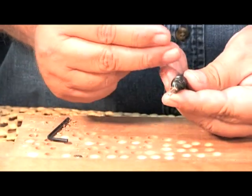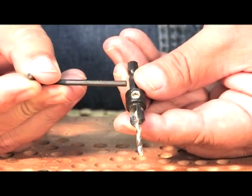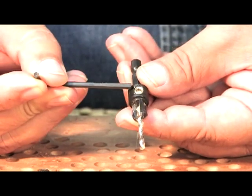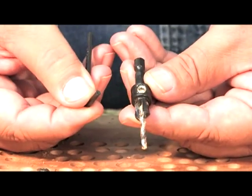Whenever you're drilling with different sizes of material, you need to extend your bit out. One of the major complaints a lot of our customers tell us about with a lot of the countersinks are the set screws are just too small. Not only are they too small, they're too soft — they strip out. So what we do at Snappy is we put an oversized set screw in, and the set screw itself is harder than the Allen wrench.